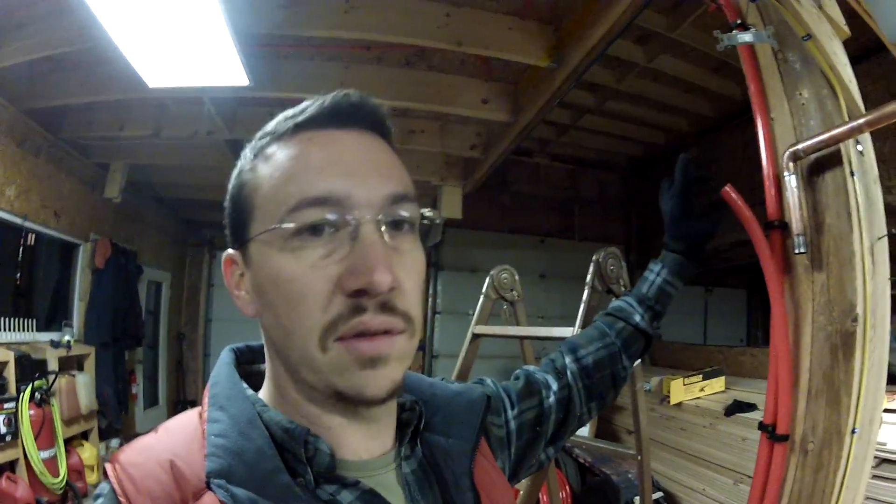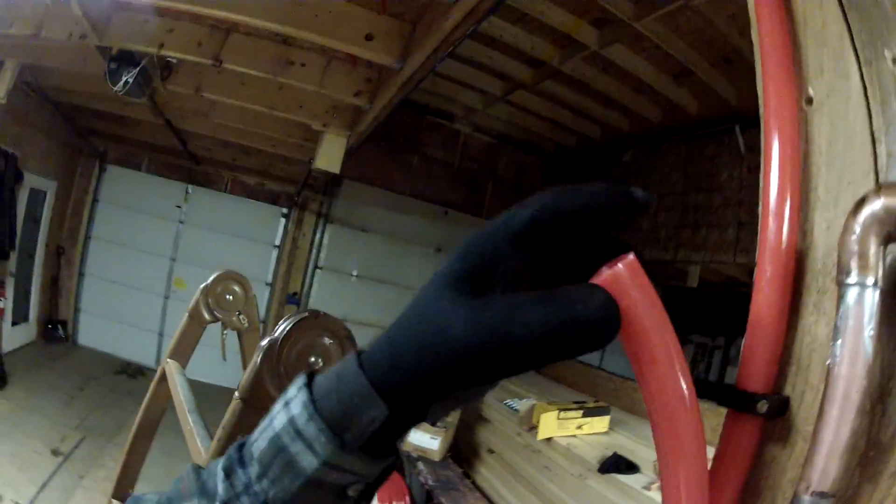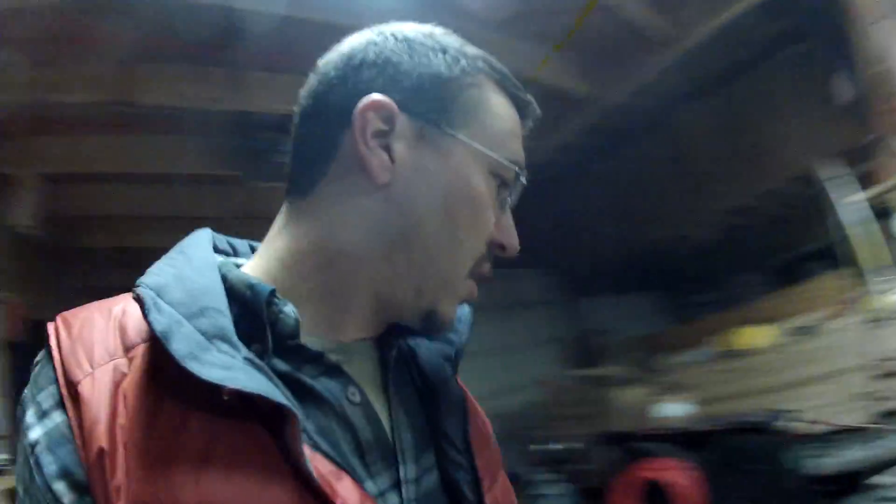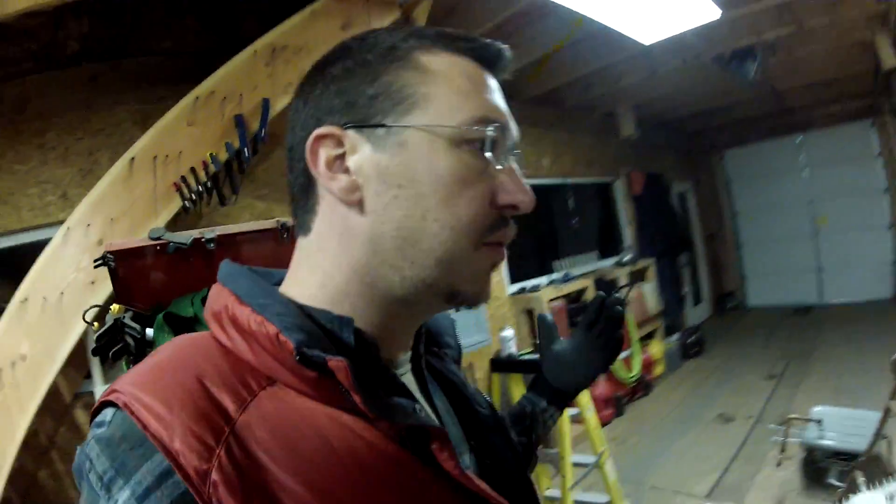I got both the elbows soldered on, just for the little downs. Not the cleanest soldering job, but that's the way it goes — I didn't have my rag on me to clean the solder drips off. Now I'm going to get SharkBite couplings, put them on here, connect it up. I'm so organized, aren't you impressed? I got my couplings in and now I'm going to go fill it with water and see what happens.